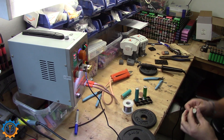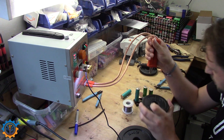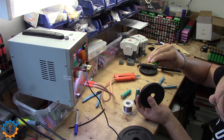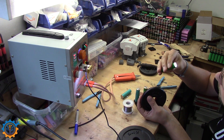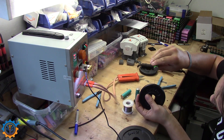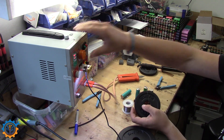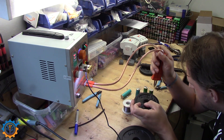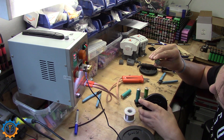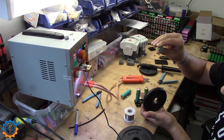So that's the first scenario. What if you use too little current instead? What will happen then? So let me turn this down and let's say we go with half the current that I used before. Half the current, or half the energy as before. And it broke at the weld points. So let's do that again - half the current - and it broke, it seemed to hold just just a little bit. So let's go back where I was, just to make sure that we actually have it working. And that seemed to hold a lot better. Yeah, it holds a lot better.